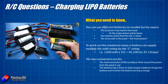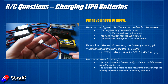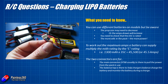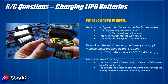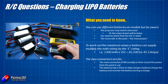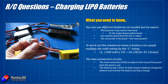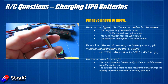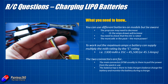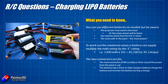The other connector on the battery is called the balance tap. As well as the main connector for power, the balance tap allows a charger to monitor individual cells while charging. You can also use it as auxiliary power for something like FPV gear, though you can't pull a lot of current through the thinner wires. If you're ever unsure how many cells are in a pack, count the balance tap wires and subtract one — so four wires means a 3S battery, three wires means a 2S.